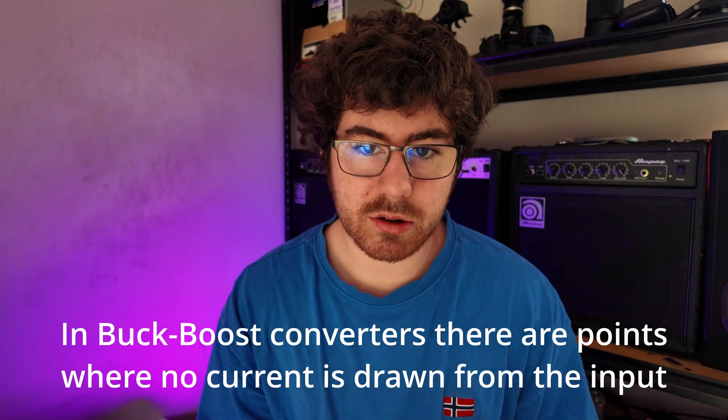Also, this is a higher quality inductor with much more advanced machining techniques than the slightly smaller, slightly crappier one. The same thing goes for the capacitors. On that board they're about this big, which isn't that big — these are already very high quality, small capacitors. However, in the world's smallest power bank they're a lot smaller; I don't even know if you can see that spec on my finger. I was able to achieve this by switching at a higher frequency, but also by using a boost converter rather than a buck-boost converter, which means I need much smaller input capacitors because there's no discontinuous current on the input.